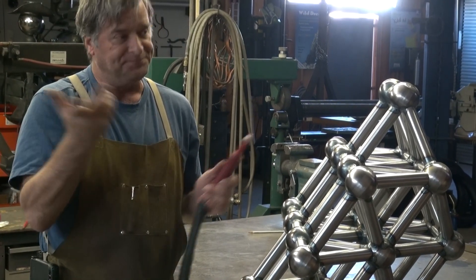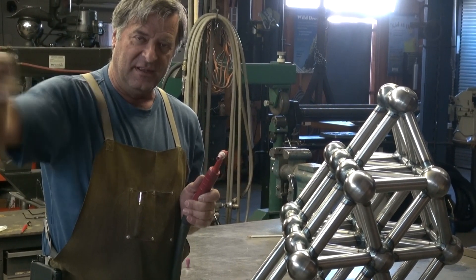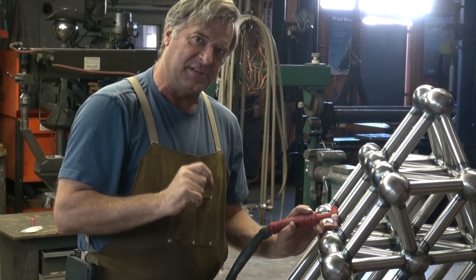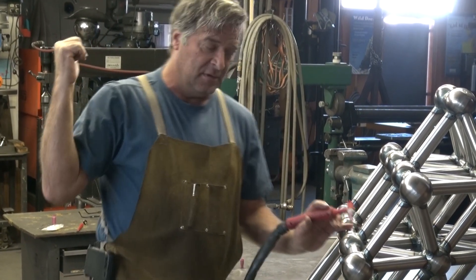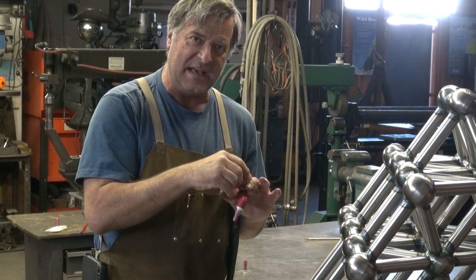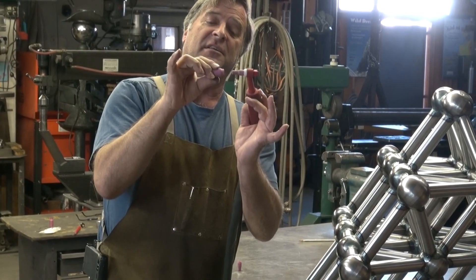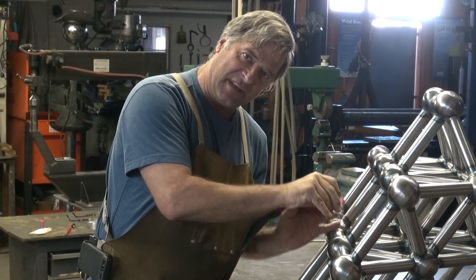Just like a garden hose — if you've got a really small garden hose, you get lots of pressure out of it and it'll shoot farther than a big diameter hose with the same amount of pressure. So you'd get more gas pressure, but it becomes more turbulent because the pressure is higher. You can either turn your flow rate down, or that's where the gas lens comes in — the little mesh will smooth out all that turbulence, give you better coverage and less flow so you save gas. But the problem is the cup is much, much bigger, so you're back to the same problem: the cup is too big for the area you're working in.